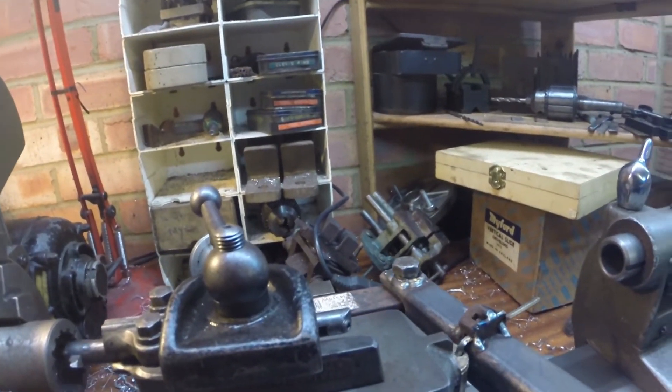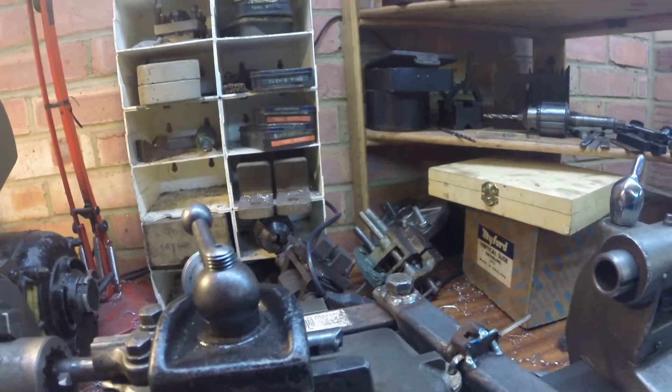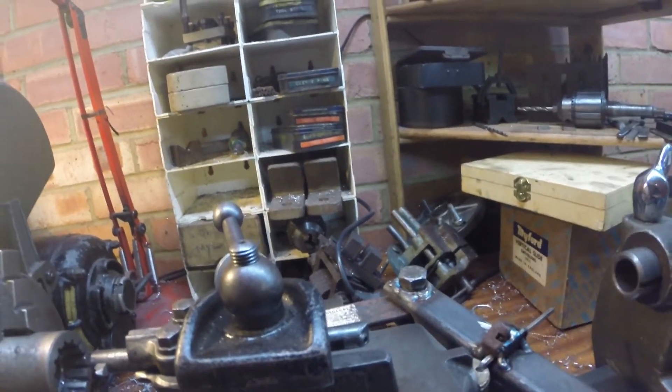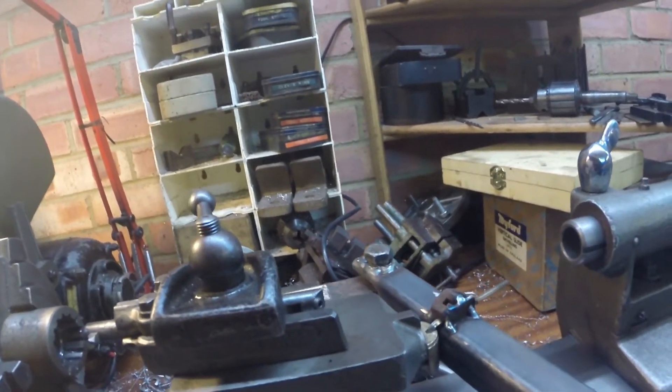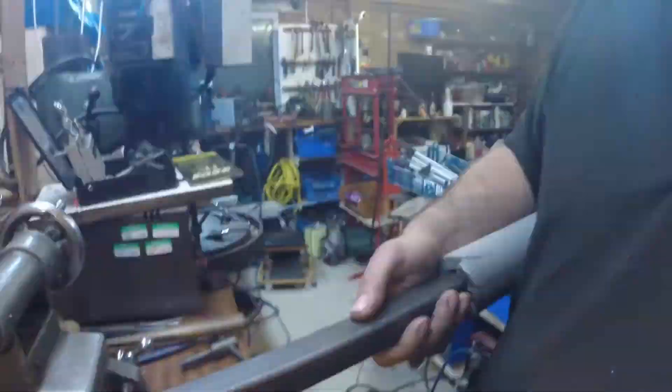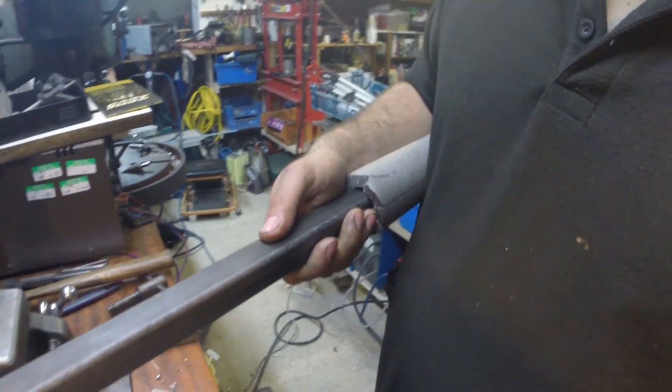There's a video of this and I'll link that down below — apologies for the quality. All I've done is removed the lead screw from the top slide, indicated it parallel to the bed, and mounted a form tool in a boring bar. The setup is deliberately dangly to stop it rocking the tool about. The tool is advanced with the cross slide and the carriage is locked. It's crude, but it actually worked really well.